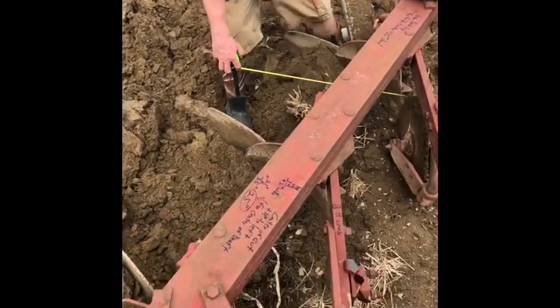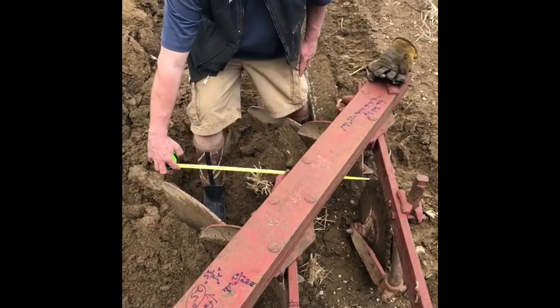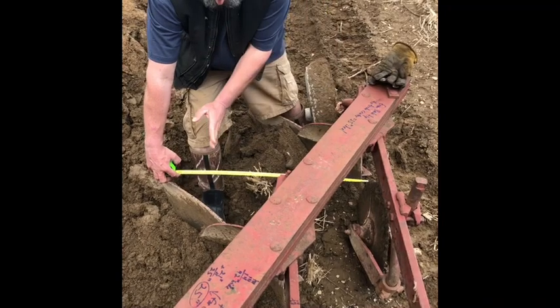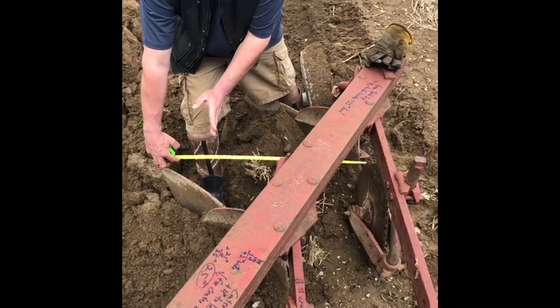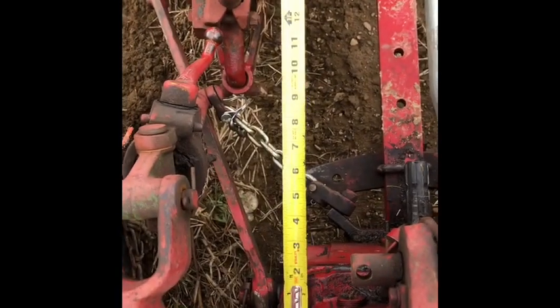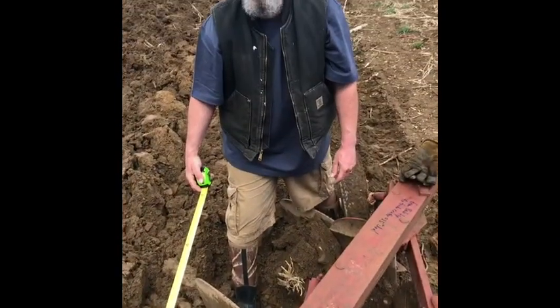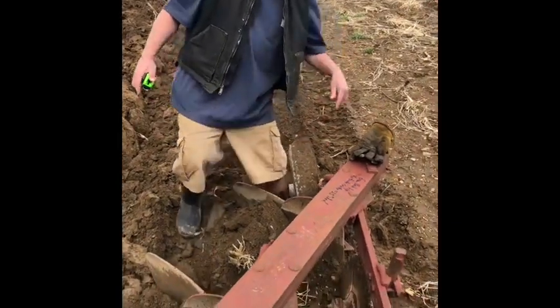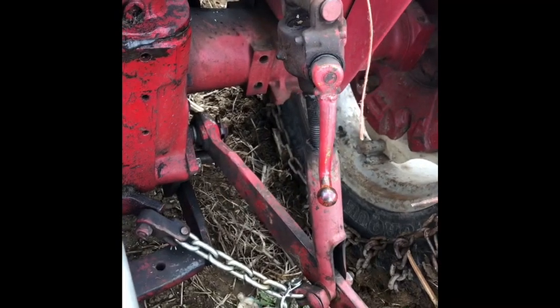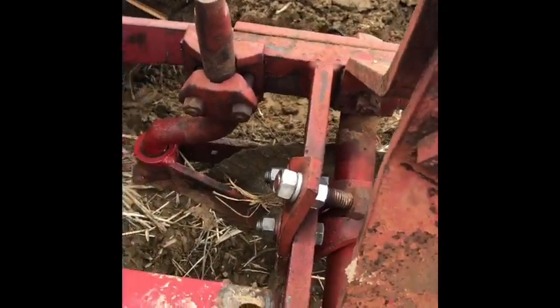So if I look at my 25 inches — there's my note, 25 inches ideal — there's 25. I'm still over but I'm on like the edge of the tractor. So if you look at my 25, I'm here on my center line of draft, whereas before the center line of draft I was the whole way over here, and this is pulling that three-bottom plow now — whereas before it didn't. The adjustments we also made: that tail wheel we raised up because I had that wrong. And then I raised our right-hand lift arm up more rather than down — it's on the top pin. And this arm on the left-hand side we adjusted it downward and put it on the bottom pin. So it's working pretty good.